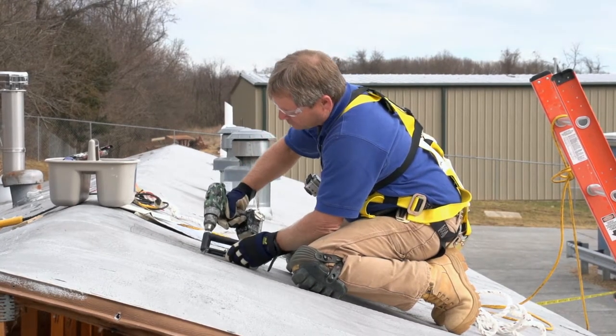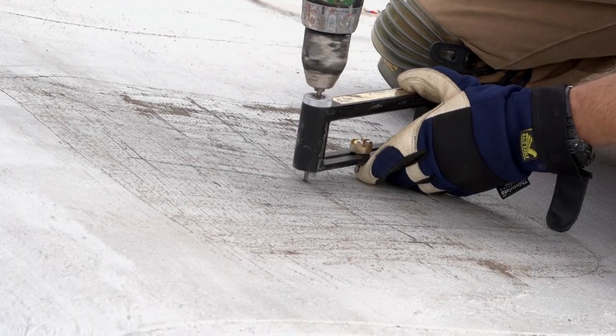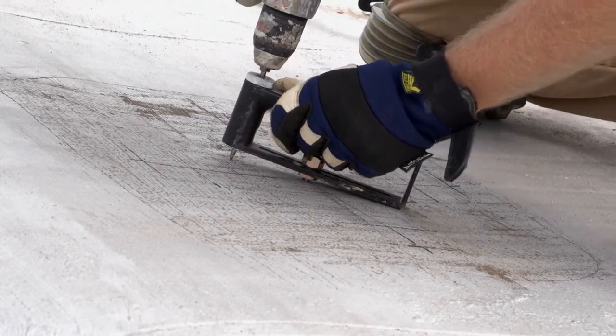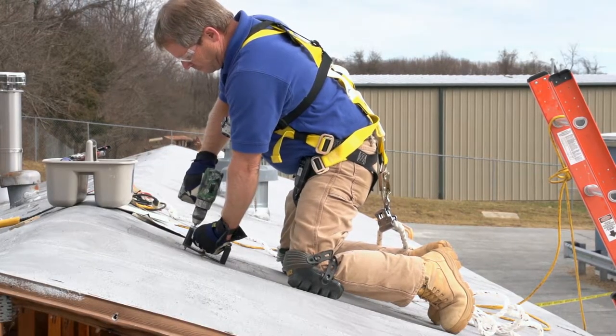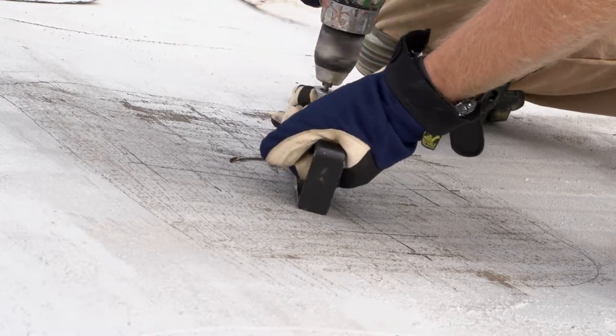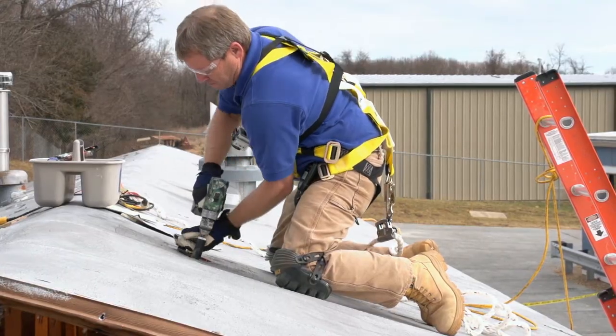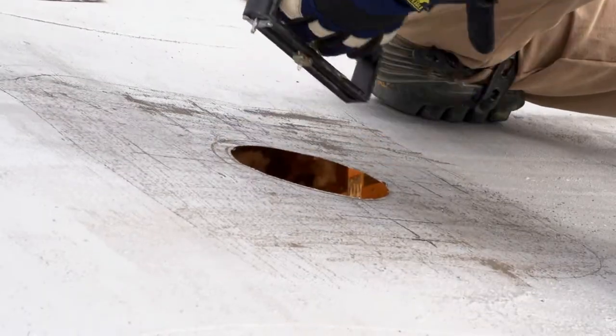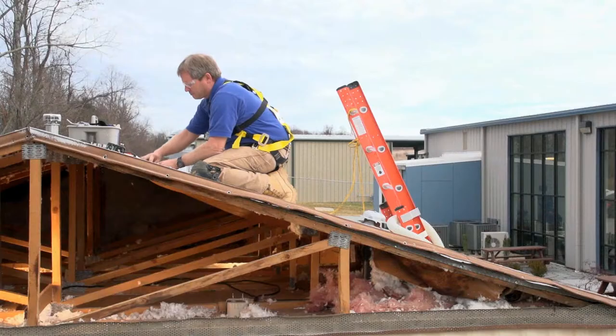Using the Malco cutter, drill a pilot hole at your marked center location. Making sure that your Malco cutter guide pin is set for a 6-inch hole, set the guide pin in the pilot hole you have just drilled. Cut the 6-inch hole using the cutter, ensuring that you are going clockwise. Keep firm and constant pressure, otherwise your cutter might slip. Once the hole has been cut, protect yourself and your fellow workers by installing the slit garden hose around the edge.